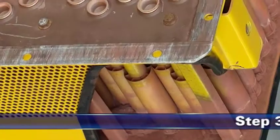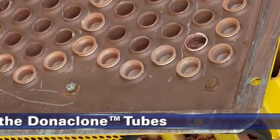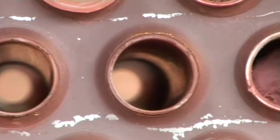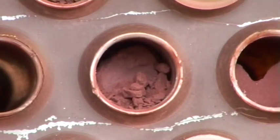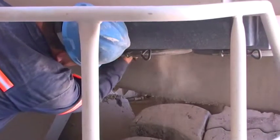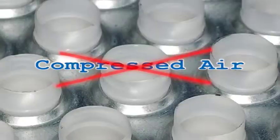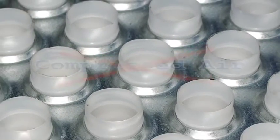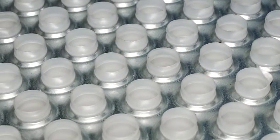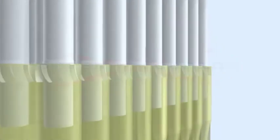Step 3: Inspect the Donoclone tubes. Check the Donoclone tubes visually. Generally, the tubes are self-cleaning and need no service, but under unusual circumstances, plugging can occur. In those circumstances, cleaning with a stiff brush may be required. Never clean Donoclone tubes with compressed air unless both the primary and safety filters are properly fitted in place. Do not steam-clean Donoclone tubes.